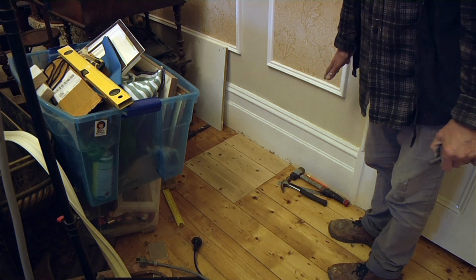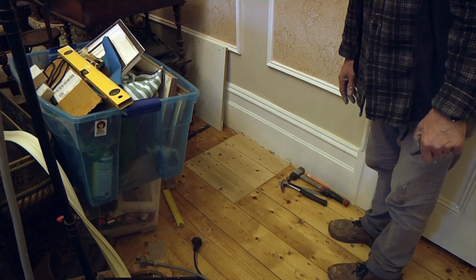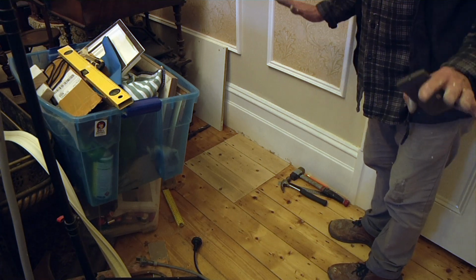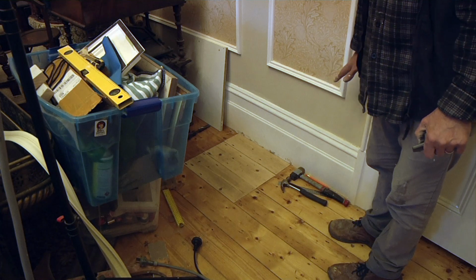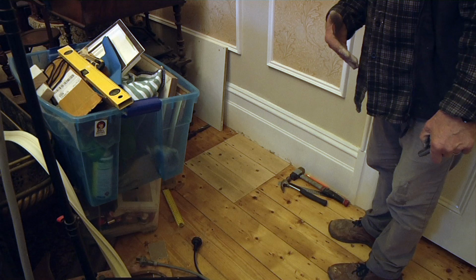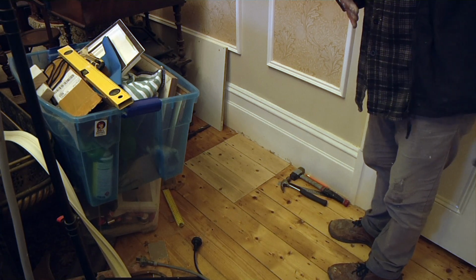In any case, most of this floor was in pretty reasonable condition, so the floor sander told us when he came in and had a look at it. It's a bit unusual because normally they've been butchered and damaged and all sorts of things, but the floor in this house, because this is an 1800s house, looks like they black japanned around the edges. They put a big rug down and it has not been touched for probably about 100 years, because we could still see the black japan when we pulled up the nylon carpet that was originally down here. We could see underneath the rubberized felt where the original carpet sat, the rug, because it was still black japanned and clear finished in certain spots.